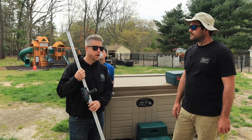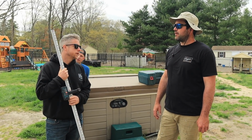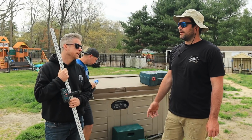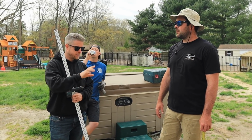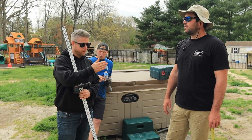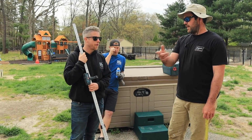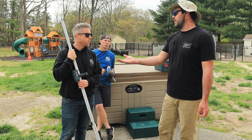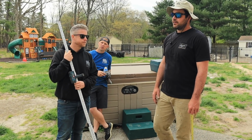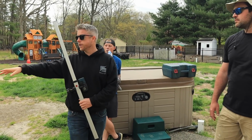The haunch, it's 8 inches deep. Where does the pile need to hit in there? Just in the middle? Roughly the middle of it, yeah. So then it needs to be 4 inches. It's basically 4 inches of embedment from the edge, bottom, top. Okay, so if that's our benchmark, our pile heights need to be like 4.5 inches below that. Yes. Okay. So let's get the machine.